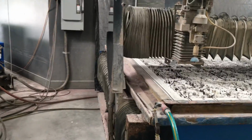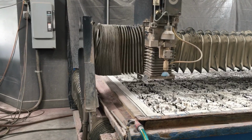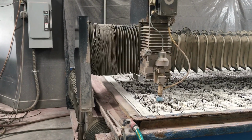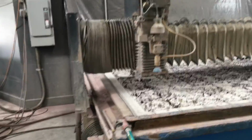Okay, so I've got my file. Now I want to bring it down to the material slowly. You can see here you have 4 options of size. You can set each one. We always call it in the shop J1, J2, J3, J0. J0 is infinite travel, so that would jam on the part. J1 I've got set to exactly 1 inch.